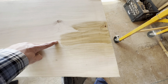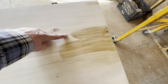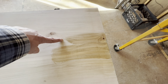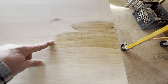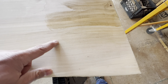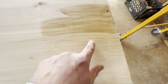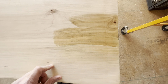Here's the poly oil-based — that's a lot darker. And here is the tung oil. The tung oil is not gonna have a sheen unless you do a lot of coats. The semi-gloss poly should have a nice finish after a couple coats — I think that's what I'm looking for. The water-based satin doesn't show much, it's gonna be kind of a rough matte finish, which isn't terrible for a stair.